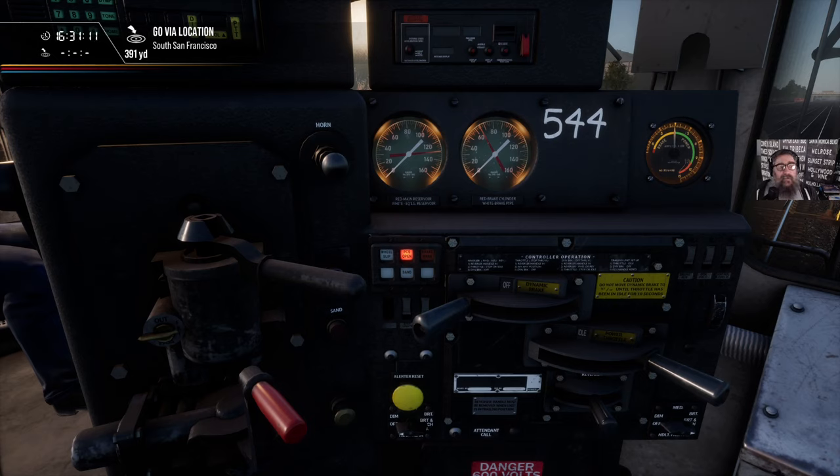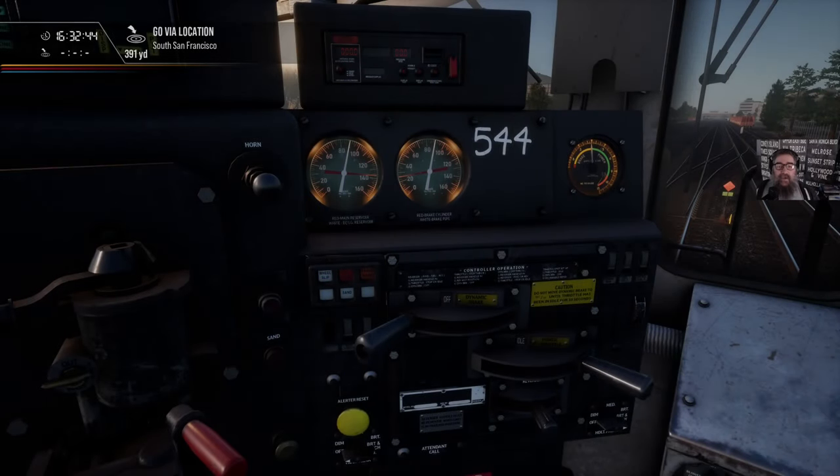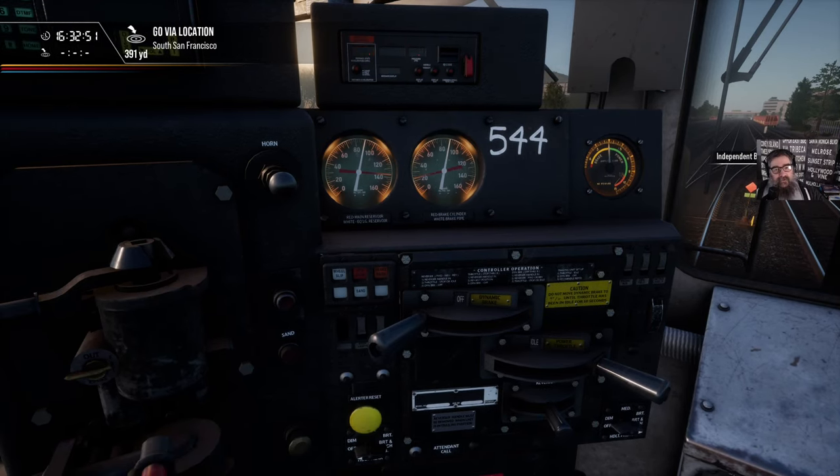We're not far off now — we should be able to release shortly. There's 31:20, that should be about the right time. Let's try and release — and the PCS light has indeed gone out and our brake pressure has started to go up. To make the pump run faster, just put the engine into notch one because it'll ramp the diesel up a little bit and run the compressor a bit harder. All right, we're finally ready to actually do our job. We've done all our tests, we've done all our checks, we've got our locos up and running. Brakes off, into forward — and away we go.